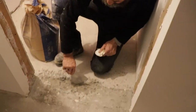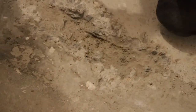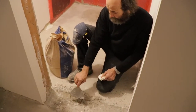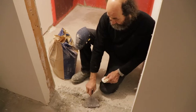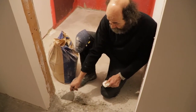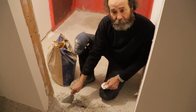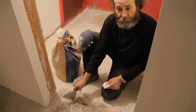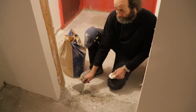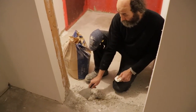You can see the knife going in there. What I'm gonna do here is break this part until I reach the bottom, and then I'm gonna seal it with some fast-set cement. Then I'm gonna seal it with red guard and then put a finish coat on top. I've done this in the past and there was 100% no moisture coming up. I believe this is the source of the moisture here.